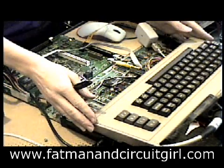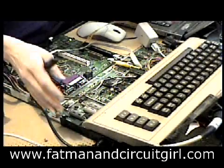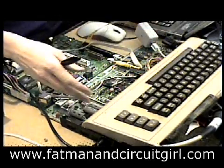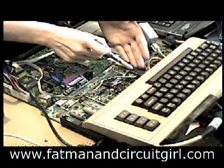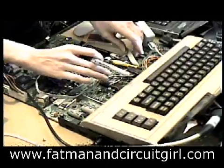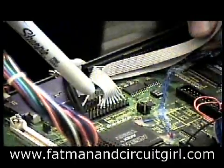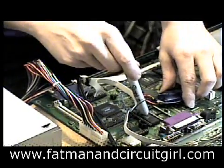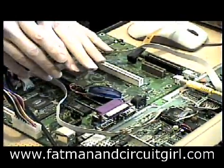Here's my setup. Here's an old breadbox Commodore 64 — I've taken it apart. This is actually one of the Commodore 64s that I destroyed when I did the C64 30-in-1 plug-and-play. It's extremely hacked — it's got all kinds of stuff hacked all over it. I have a real C64 SID chip here that I've elevated on a chip socket. I've hooked a bunch of wires up to it and run these wires down to an FPGA board, and on this FPGA board is another SID chip.